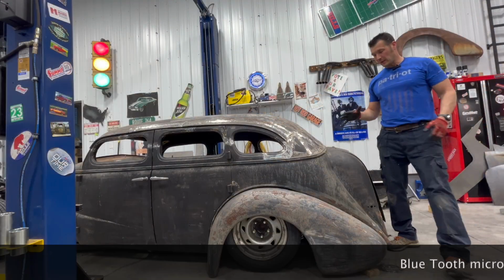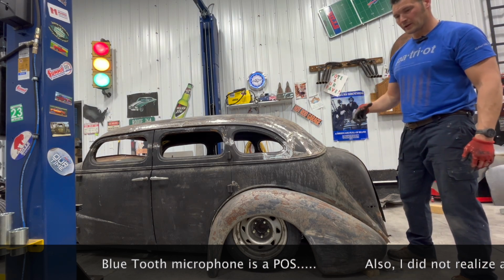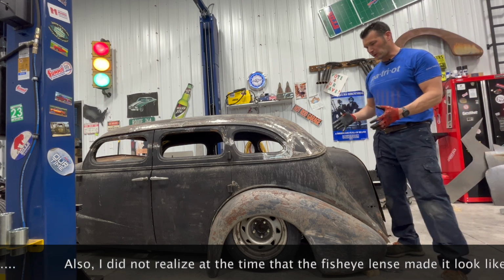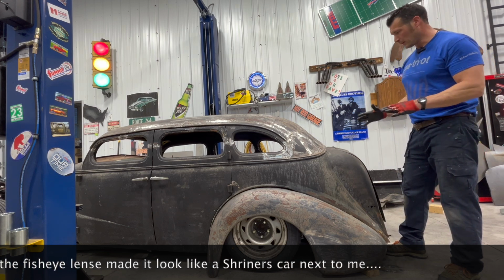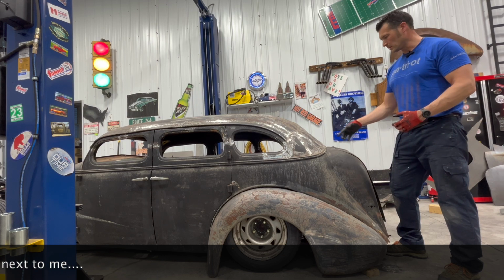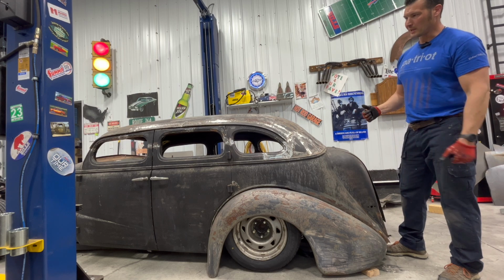All right, well, I just had to do this. When I notched the fender well there, just so I could get the axle up into there as far as I could, this is where we ended up. Man, this thing looks awesome slammed on the ground. So it's going to go up a little bit because I'm going to put some rubber bushings in there underneath the frame that I made back here. It's resting on the S10 chassis.